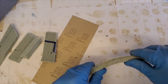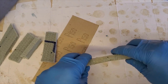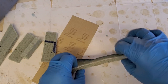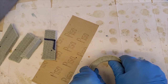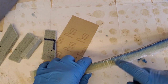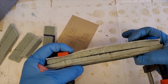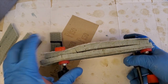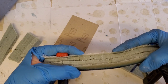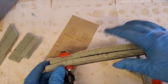With chop mat applied, if we try and force it one way it doesn't break. Even bending it right around and putting stress into the GRP, it's not breaking. This is just a crude experiment with two bits of GRP one either side — if that was a single bit of foam glued in the middle, I can't bend it either way. So it's very tough — I like it.